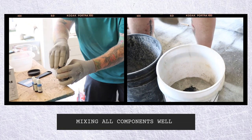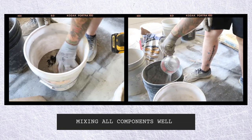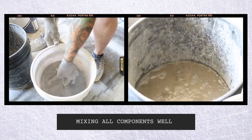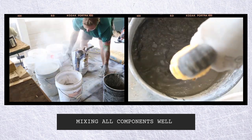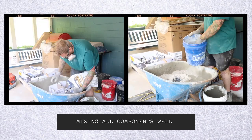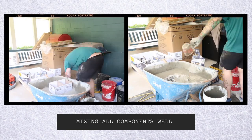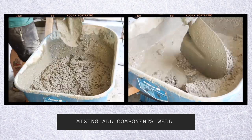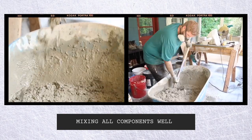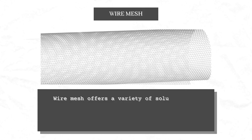For the mix, we're going to be doing equal portions because we want this to be equally as strong throughout the concrete — same color and same consistency throughout the whole pour. I started with a bucket and a drill, but that proved a little too slow and my drill was burning up, so I switched to a wheelbarrow and a shovel.